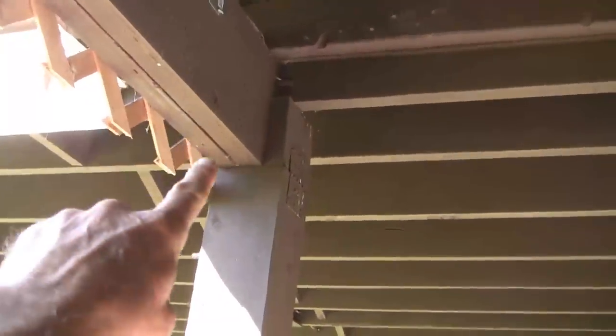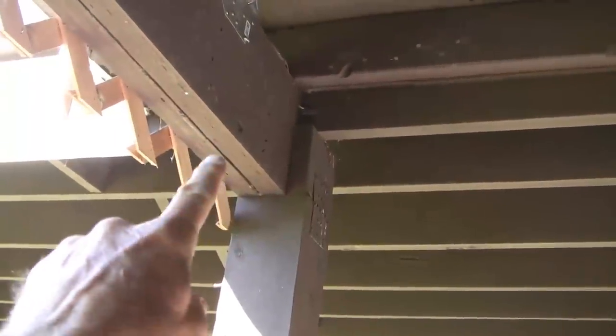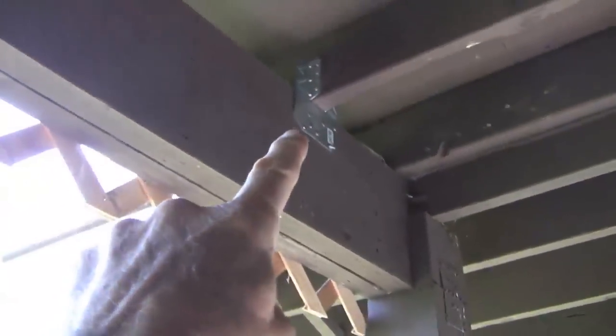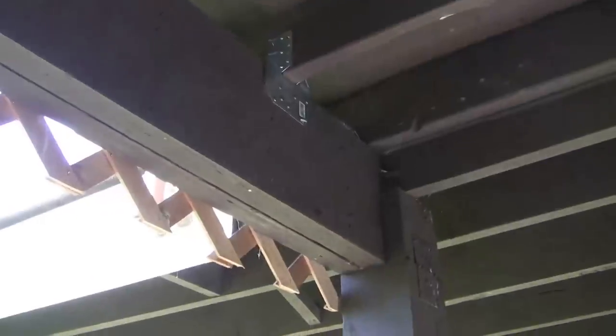It may seem like the most logical thing is to jack from here, but my base directly underneath isn't particularly stable and I don't want to come at this from an angle in case it twists. So I'm going to put my jack right underneath these beams here and hold the whole floor up. In preparation for that, I've thrown some big long nails into this longer cross-member joist that goes all the way across, and to prevent the beam from falling down when I take the jack out, I've got some hurricane clips on both sides to hold the beam up.